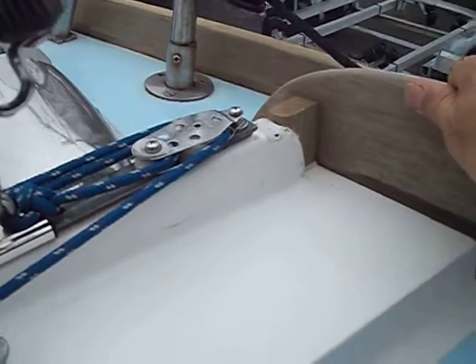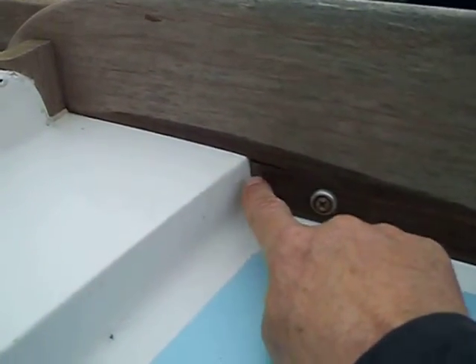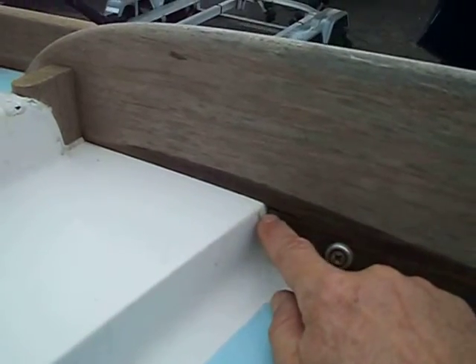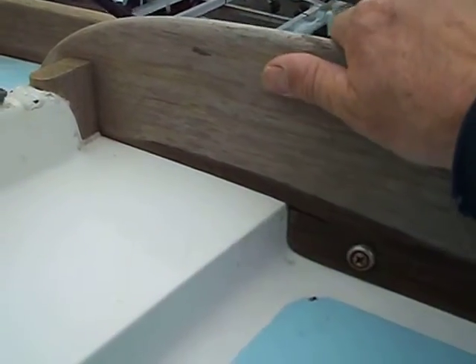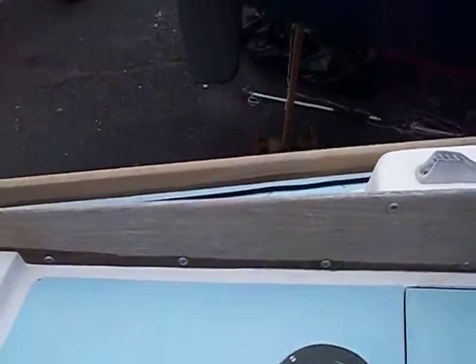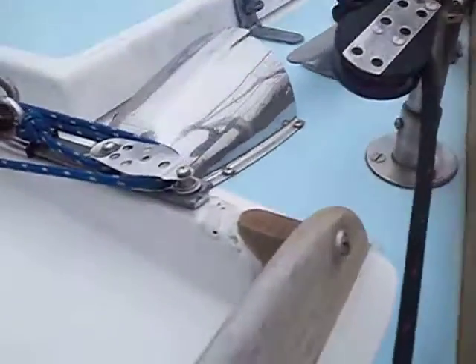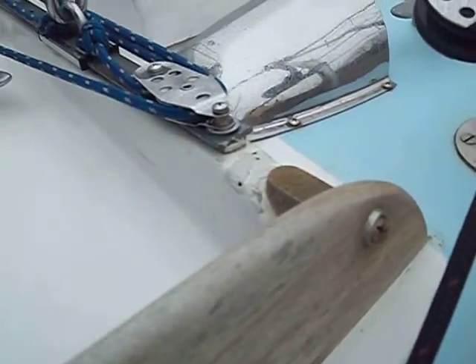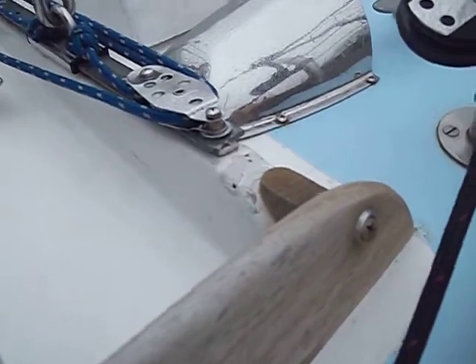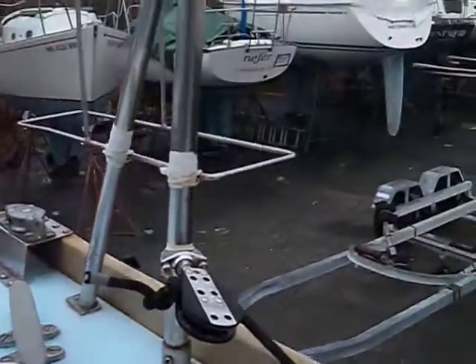You can take your boards and move them up here. This is a weak point — there's a crack on this side. When they cut a 90-degree angle like this, it creates a weak spot right there, and if there's any flex in this board it's going to split just like yours did. We have almost identical combings and there is no screw here on this side holding this together — one that goes all the way down into the meat with a long screw to support this.